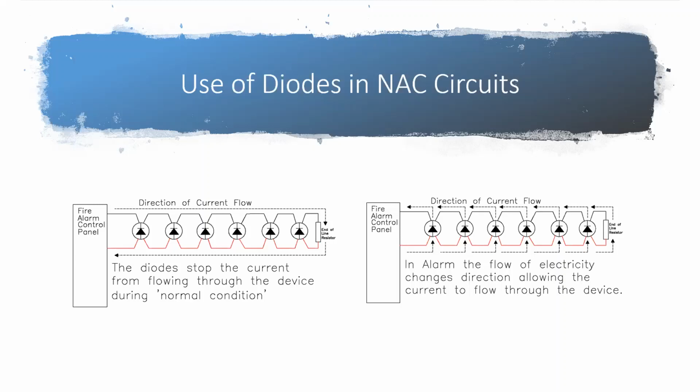And if you look down it, you'll actually see that it lists the devices in order of the circuit, and it tells you what the theoretical voltage amount is at each one of those. And we do it that way so that I make sure, one, that we're not going to overload the circuit so you'll have devices that won't work. Also, to make sure I'm leaving enough headroom in there.